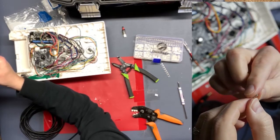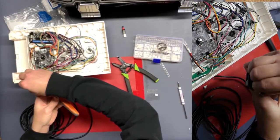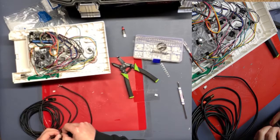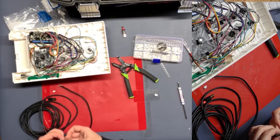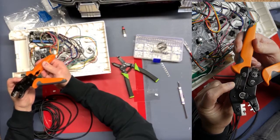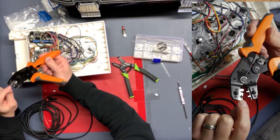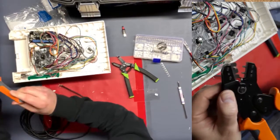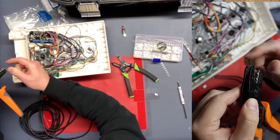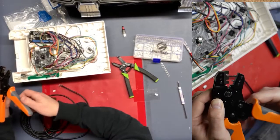These little things need to be fixed to the end of each wire. I don't know if any of these are going to be visible on camera — it's so small. This is the side with the label towards you. This is the side that has the ribbon that it was cut from. I have to make sure that I'm not crushing the connector head. I want to make sure that's not being hit, so I push it so that it's all the way through. The little tabs — the little wings — they're facing down inside this crimper.